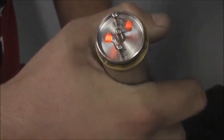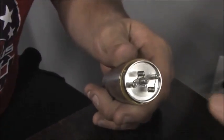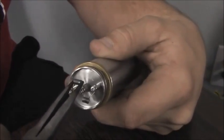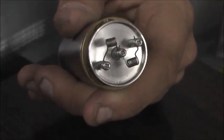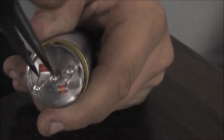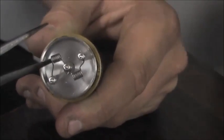See, you got that hot spot right there. So here — we've got a little bit here, a little bit separated, so give it a little quick pinch together. Make sure whenever you're using these that you don't fire the button while you're working on it. You want to get it hot, let go of the button, and then mess with it. Should I fire it up first? Fire it up because we need to see where we need to tweak it. It's almost dead on, though this one fires just a little bit slow. Let's spin it around and work with this one. When it fires slow, what do you look for? We're trying to make it so all the coil wraps fire together tightly. If it's coming on slow, you want to pinch it on each side and then stick the needle nose directly through it and pinch it together. Then fire it up.